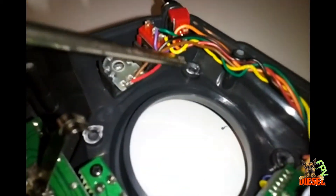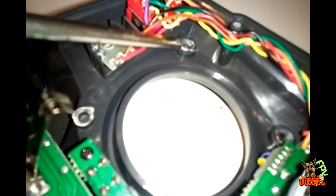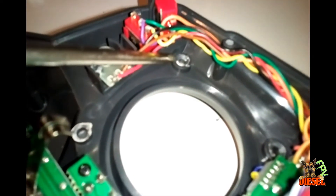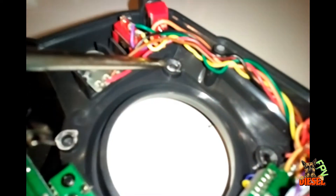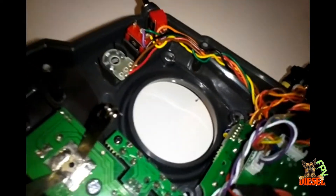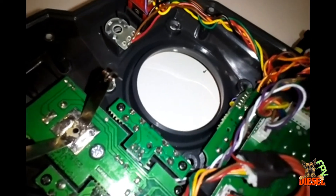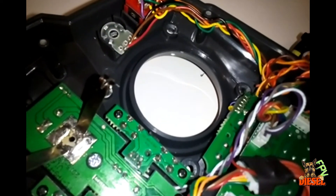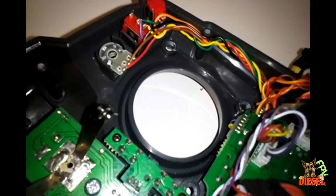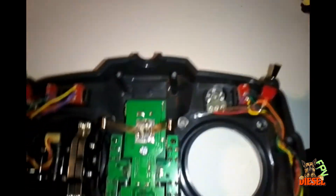On this one, for example, there's an outer lip and then the lip that stands up. If you grind down this tab until it's flush with the outer one, don't go any further than that or you'll wallow out your screw hole and your bolts won't hold. The reason I had to do this is the gimbals fit fine with the standoff there, but the old gimbal screws would not tighten up in the FrSky gimbal, so I had to use the included screws — and they're too short, hence why I ground those down so it could sit flush.